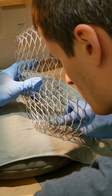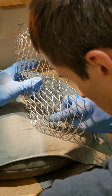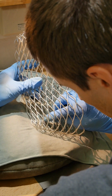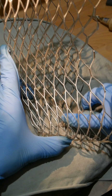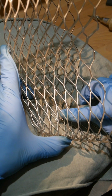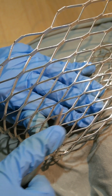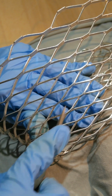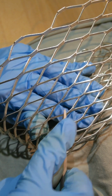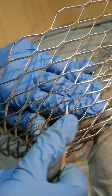Before soldering the two halves together, I needed to clean up all of the inside edges. The cut surface from micro water jet cutting was already quite smooth, but the burrs I created when chamfering the cuts in the first place needed to be filed down. I also decided to finish all outside edges because holding and working on the assembled piece is way more difficult than each half at a time.